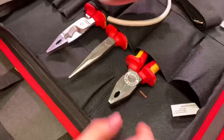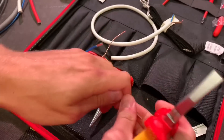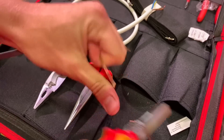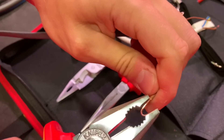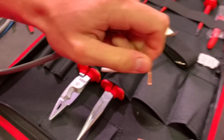So we've got the pliers — where are we going to be likely to use them? You can strip with the pliers also, but we'll be using these to double over. When we want to double our terminations into light switches, ceiling roses, et cetera, we're always going to be using our pliers in order to do so. In both kits they're almost your go-to tools — the side cutters and pliers.